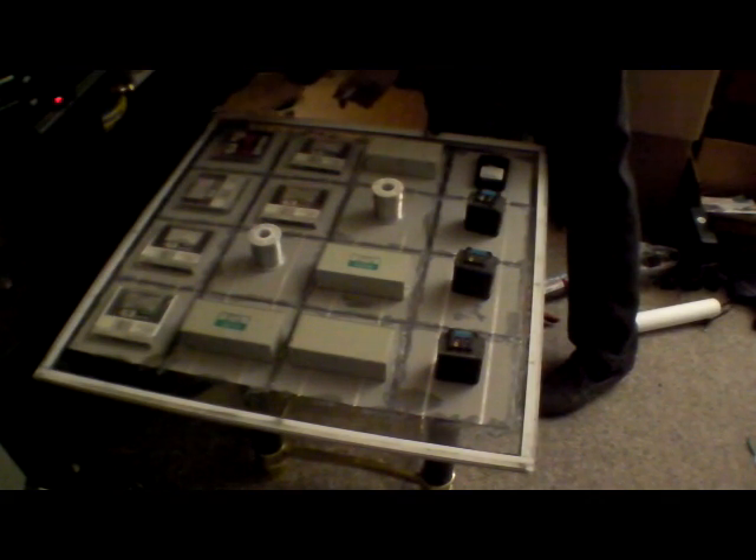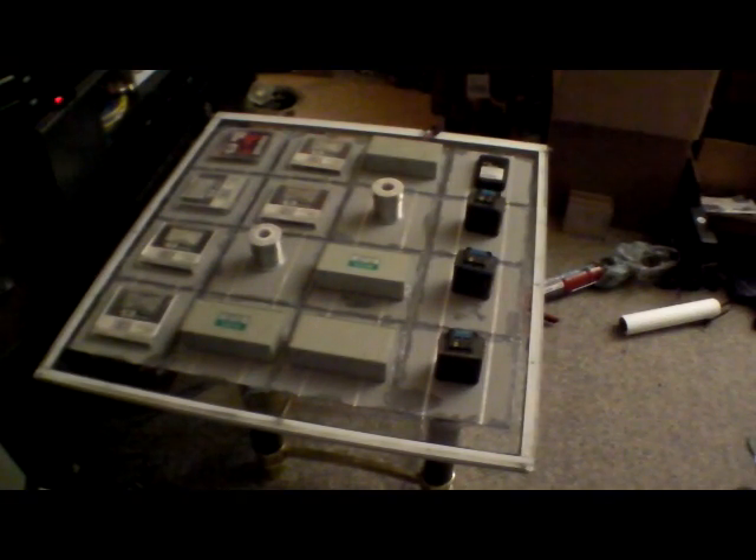See how it does tomorrow — if I get home from work I'll play with it a little more. I'll put the jump wires between the panels on, take her out in the sun if there's still sun or whatever daylight is out, and see if it makes any juice. If it makes juice I'll be happier than a pig in shit. Then we'll go to the next panel. This one here: 16 cells at half a volt each, that should be about 8 volts. Cells are supposed to be 7 amps each — if I get 5 or 6 out of it I'll be happy. It should be about 50 watts that panel will be. So we'll see what happens.